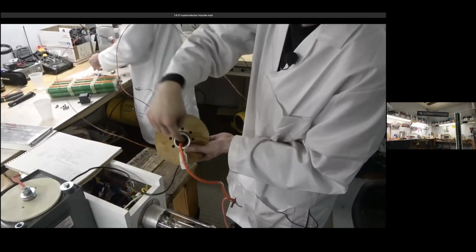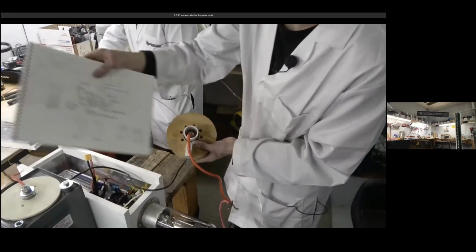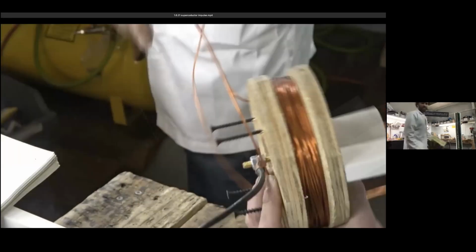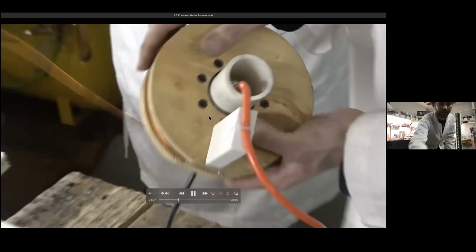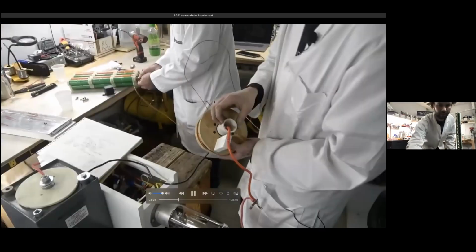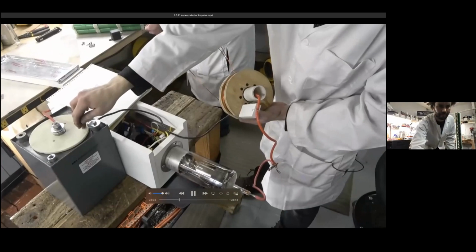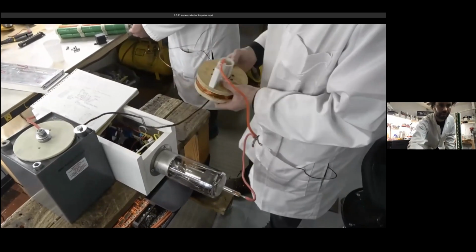You can see the top of the bolt there. The top of the bolt is one of those brass bolts shown in this image. And another one sticks out the bottom. That's our other terminal. And so that makes up the load that we're going to discharge the thyratron with, through the output of this capacitor, and just cram as much current in here as we possibly can